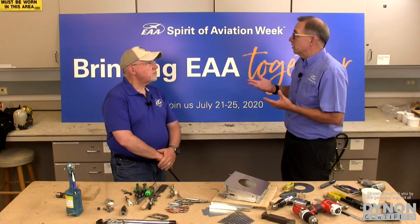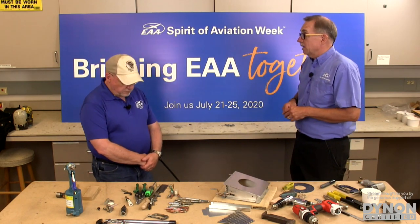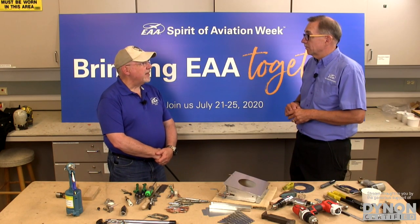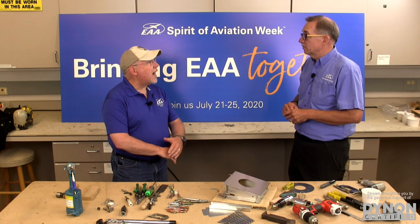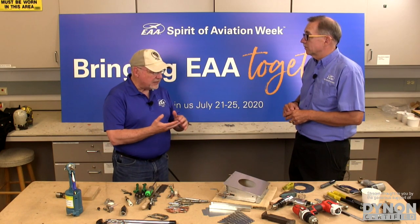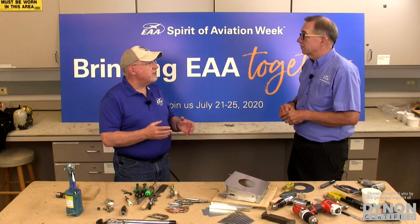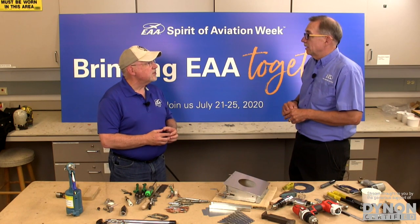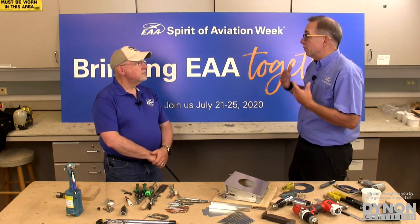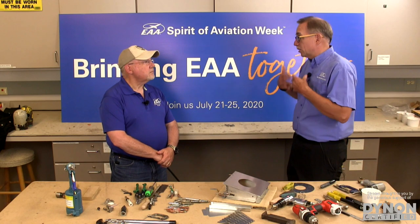Back in the day, when you built a sheet metal airplane, you got essentially a roll of plans, and you'd buy a couple rolls of aluminum and have at it. You had to do all the layout, all the cutting, all the measuring, everything off a set of plans, and you had to be prepared to work from raw stock and make every individual part of the aircraft. So it involved not only the cutting and the riveting, but also measuring and building jigs and forms to make ribs and stuff like that. Every individual part had to be constructed from raw materials, so you became a wearer of many hats. You were literally the kit manufacturer, manufacturing the parts, so you'd have to have a skill set to do that. And then you'd have the parts and put them together, so now you're the kit builder.